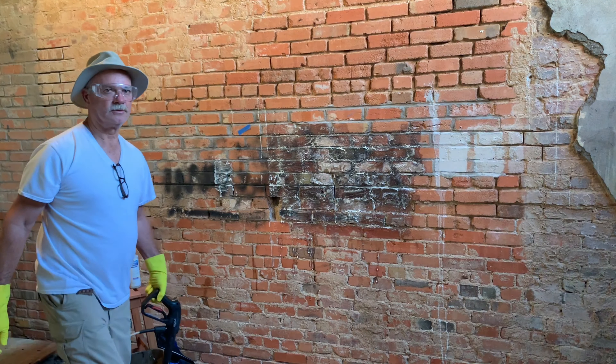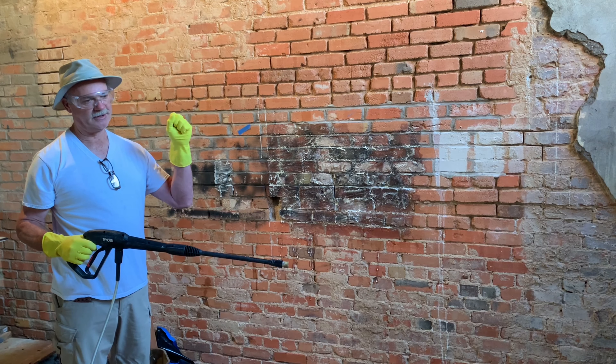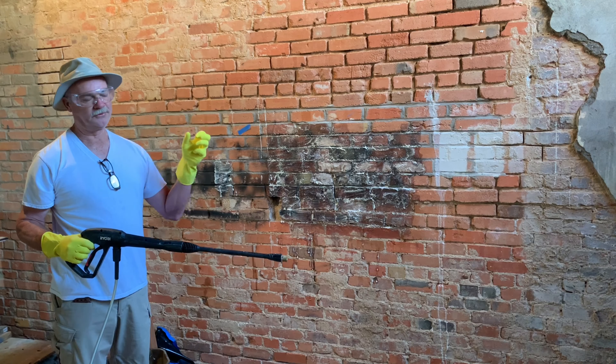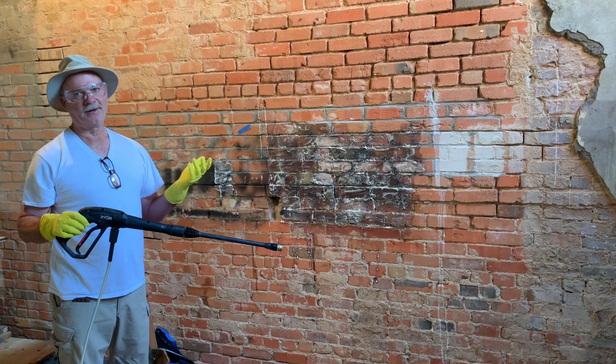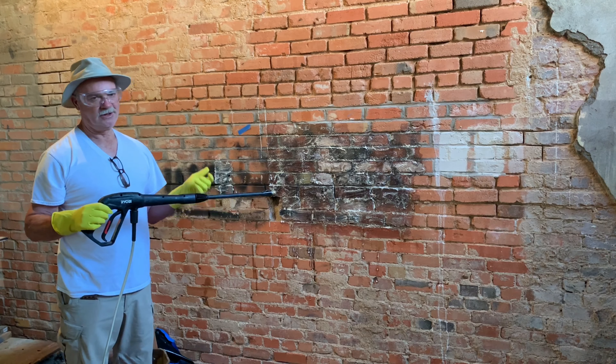You nearly always need a pressure washer to get the paint out of the pockets, fissures, and little divots of the wall, because the paint gets down into the little crevices and pores, and if you brush, you normally brush over them. We use a little electric pressure washer. A thousand pounds of pressure is normally adequate with a 25 to 40 degree fan tip. We're going to rinse this down first with water-hose pressure just so it doesn't splatter all over us. We're rinsing at an angle, which keeps it from splattering as well.